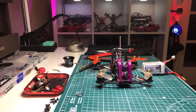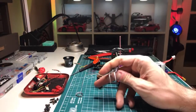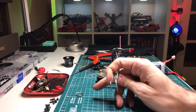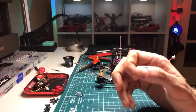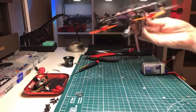I would love for it to do that on the yaw axis. So if it's not going to have the oscillations, screw it, I'll leave it on. That's kind of where I'm at, but I am balancing that. I'd actually like to back to back that, though I've never really done it because you have to change the cutoff in the CLI. But I do have one of those Speedy Bees, which gives me access to the CLI pretty easily in the field. So that's actually a good thing to back to back.